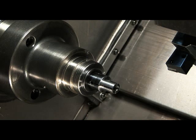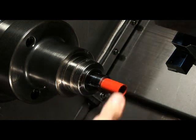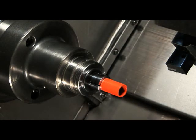At this point you will take your Allen wrench and screw the expanding screw all the way in until it bottoms into the rod. Make sure that this is tight. The next time that you actuate the collet, make sure that you have a part on it or you will destroy the collet.